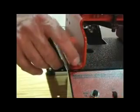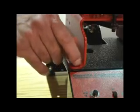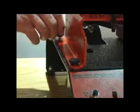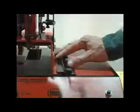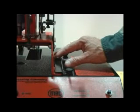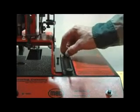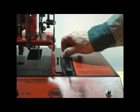Now we need to slide the reloader into the position on the top of the drive base, and with the provided thumb screws secure the left side of the reloader to the drive base first. Once this is completed, loosen the 2 thumb screws and push the right side of the hold down clamping strip to the left side until it rests against the loader base. Secure the clamping strip tightly with the 2 provided thumb screws. Also tighten the Allen screw using a 5/32 hex wrench.